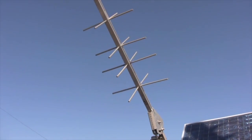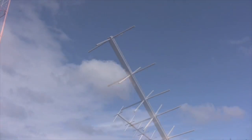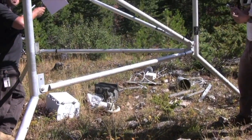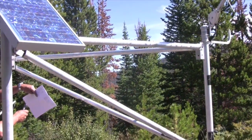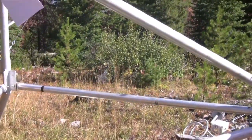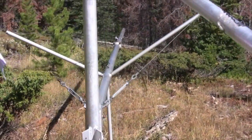The RAWS has everything needed to complete the next hourly GOES transmission, even if there's no data to transmit because the sensors aren't yet installed. If the transmission happens before you complete the upgrade, you can call into NIFC or FTS and confirm that the transmission happened without error, giving you a chance to correct the error while you're still on site, instead of waiting another hour for the next transmission.